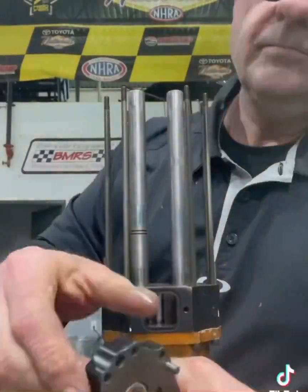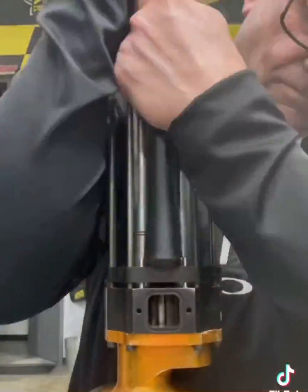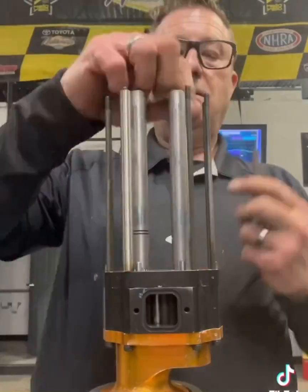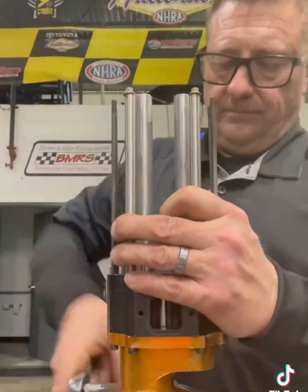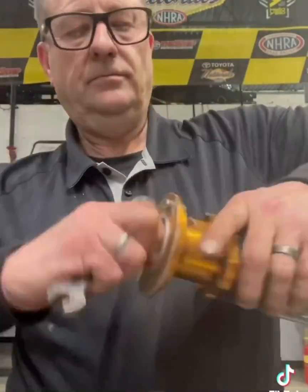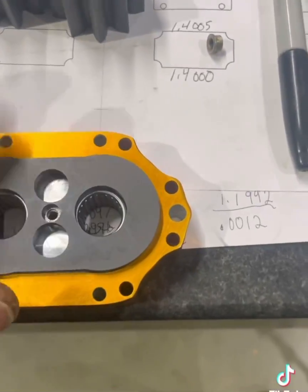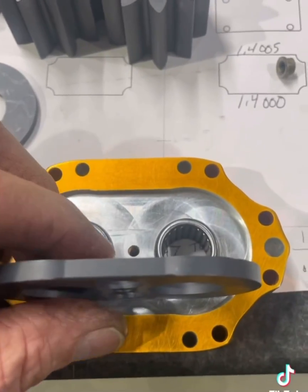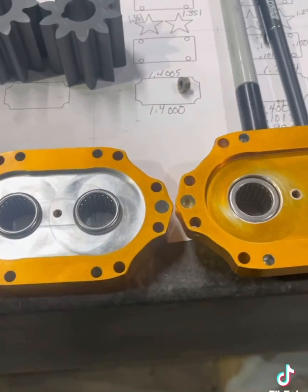I've already installed the wear plates, and now I've assembled the gears on the shaft, making sure that the gears themselves are actually loose on the shaft — we don't want the shaft influencing the gear one direction or another. After measuring everything and confirming clearances, I use long spacers and tighten down that housing to check that the clearance is okay and that this thing spins all right. Putting the second stage in, this is where I ran into problems — the wear plates for my big gears will not fit the center section housing. So I'm calling it quits tonight; I'm going to machine these things tomorrow and get this thing finished up.